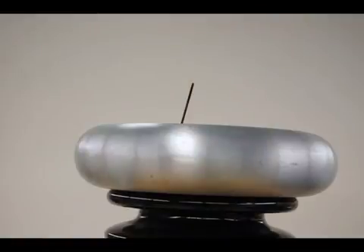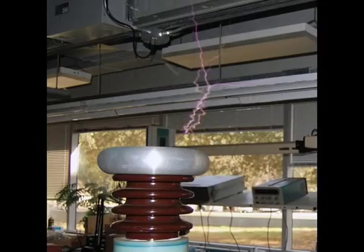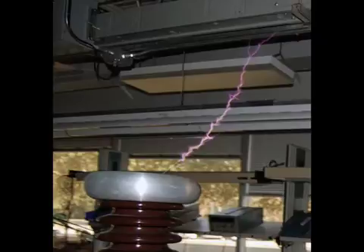Where's the capacitor for the secondary coil? The ring at the top, called a toroid, is one terminal, while the ground serves as the other terminal. And the air in between acts as the capacitor in the circuit. That's where those 250,000 volts go, creating an electrical field so powerful it ionizes and lights up the air.